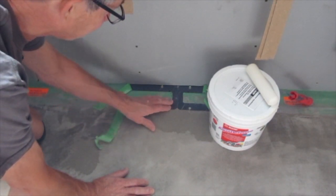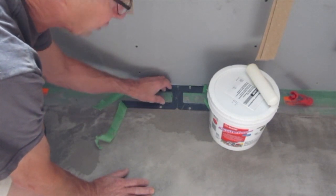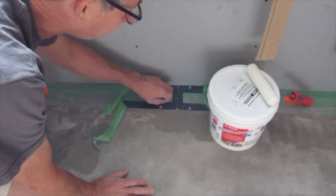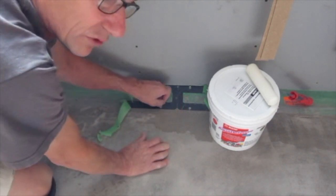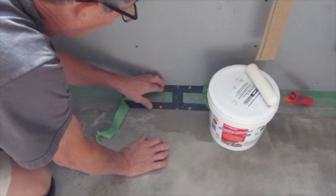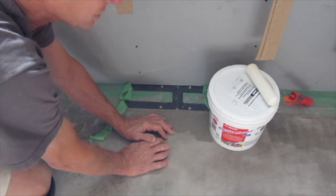and you'll have all of your waterproofing done. There are also little pins that stick up out of this drain that are the locators for the clamping, the stainless clamping bar that goes on top. And you will cut your fingers when you're taping. Be sure to push the tape down over these pins so that they protrude through, so that you can locate your drain cover in the proper position. Otherwise, you're not going to be able to see the holes because you've already covered them up with all of your waterproofing agent.